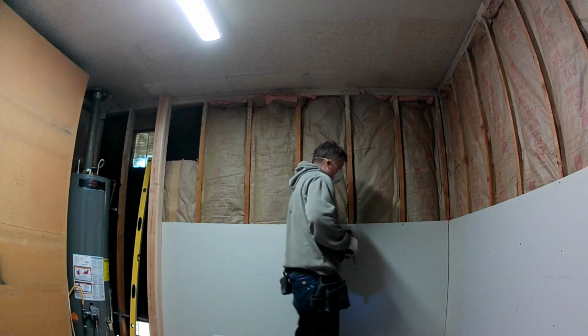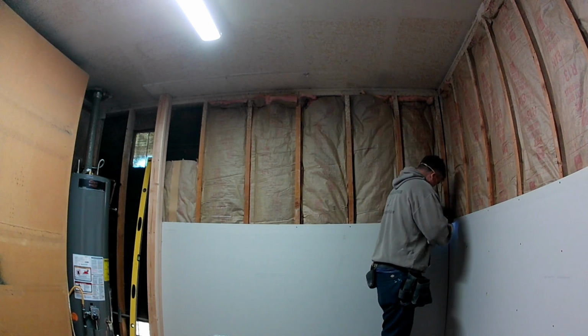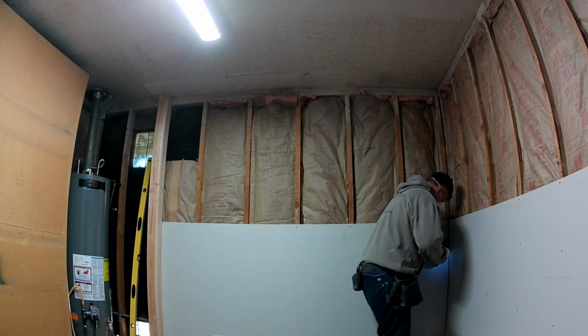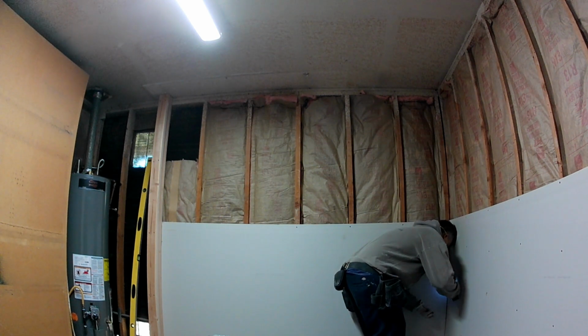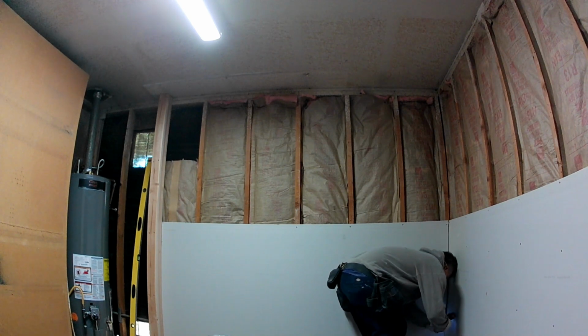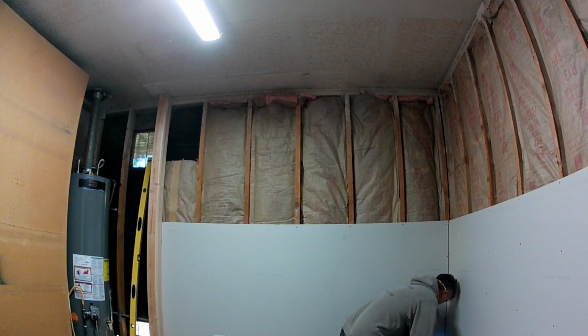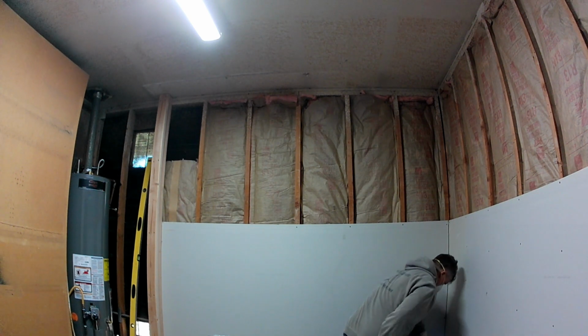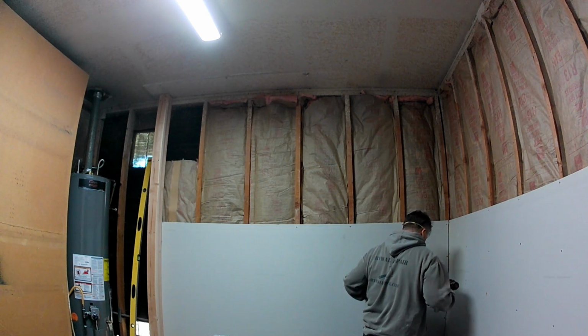This video is just going to show the insulation and sheetrocking and fiberglass process, the mudding process and all that. I'm just going to turn around and first coat everything using an all-purpose joint compound, and then I'm going to come back the next day, lightly sand it, and then I'm going to follow it through with another second coat. And that's all they wanted in this closet storage room, was just to get two coats of mud on it and call it a day. And they're going to turn around and just primer and paint over it, and they're just going to put shelving in there and use it as a storage for all their stuff in their house.